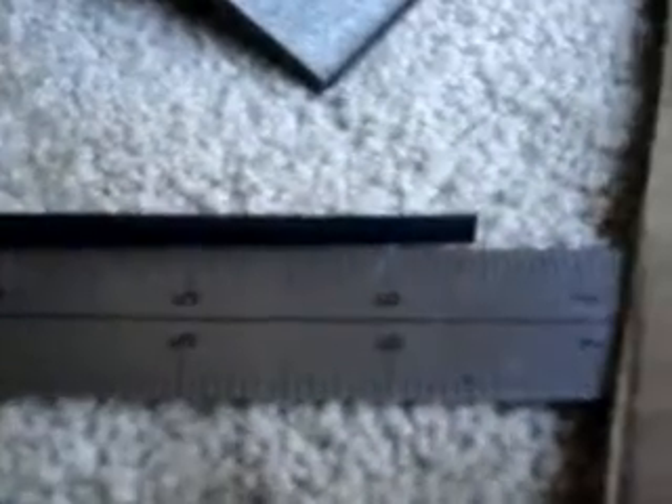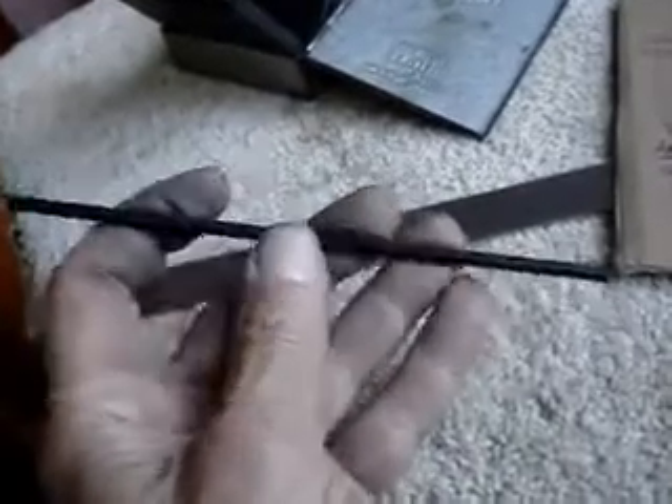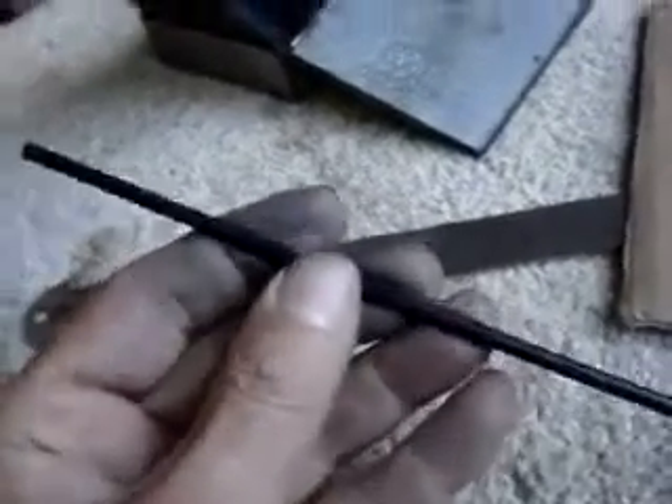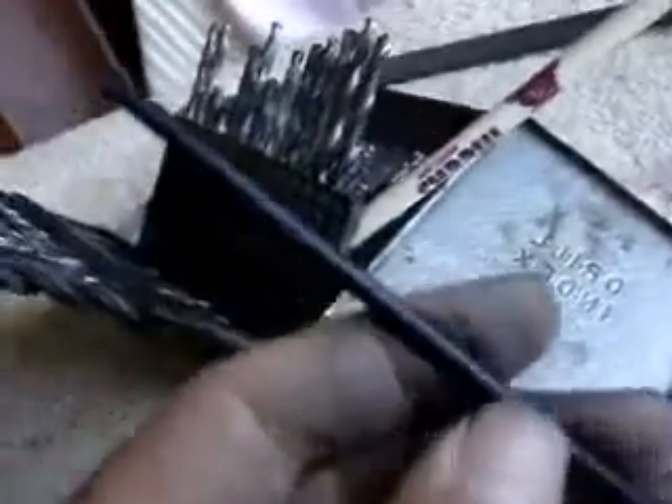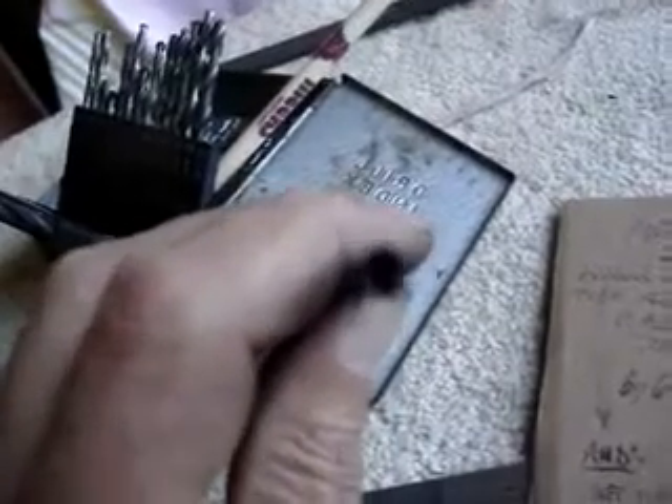Seeing as the thing is six and seven-sixteenths long, and the black plastic that I have is also scored on the OD — you probably won't be able to see it yet. Apparently they were running the wire into this Euro connector at one time and it ran down the side of this tube, believe it or not. And this tube itself is actually quite flexible. But this is for the dip pack MIG, and it's clear down the bore — you can see down the bore.